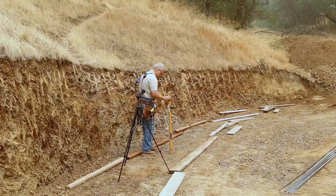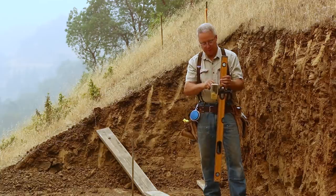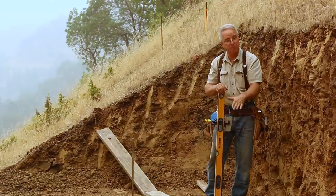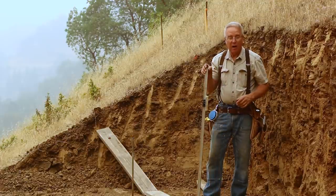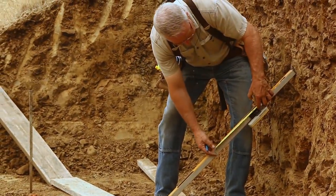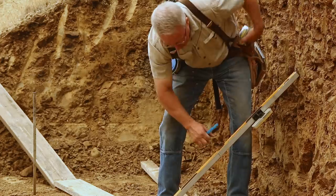This footing needs to be 12 inches thick. The inspector will object if the top of my form is not 12 inches above the dirt. So I've just verified that this elevation has clearance everywhere. I don't want to pour on this grade because in some places we're an inch and a half or two inches low; in some places we're right up to it. I want to make up that difference with crushed rock. Knowing that I am high everywhere, I will simply move my instrument — my eye — 12 inches. I'm going to go 13 inches down the rod, which translates to the bottom of this rod coming up to the height that I want the top of my concrete to be. We're going to call that top of footing.